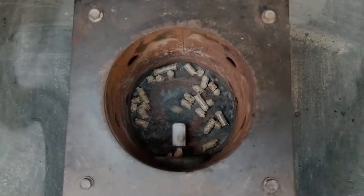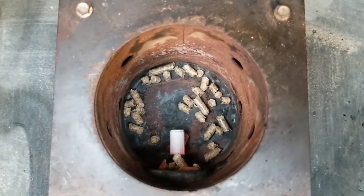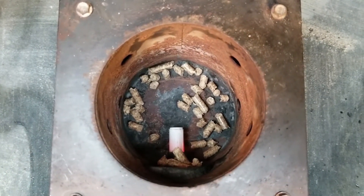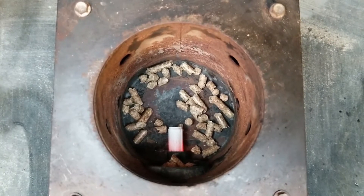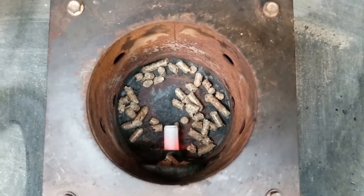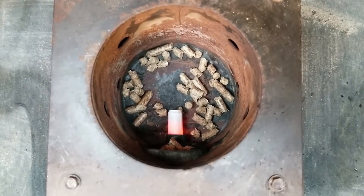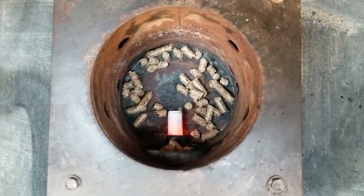There it goes. I vacuumed it out — it's probably... Why is it not running very much? Let me stop this. So we've got... I went in there and it was set to three seconds for the duty cycle, that's why it wasn't dumping any pellets in there. I went in and changed it. You can see the igniter is igniting — now it's going to get a proper amount of fuel. That'll be helpful.